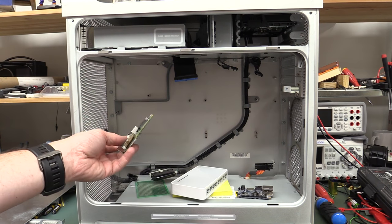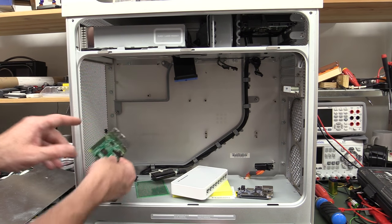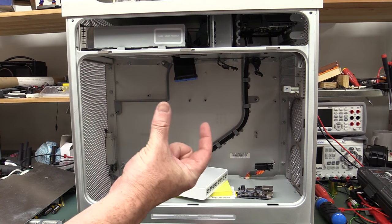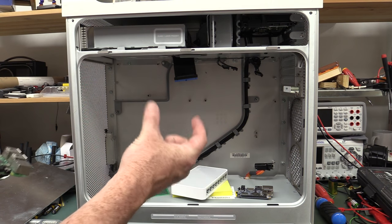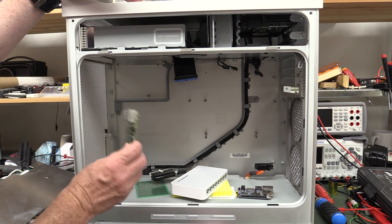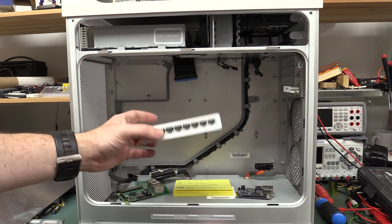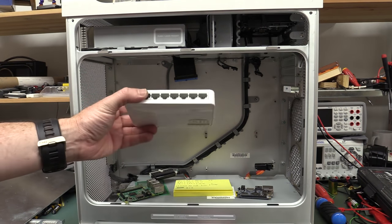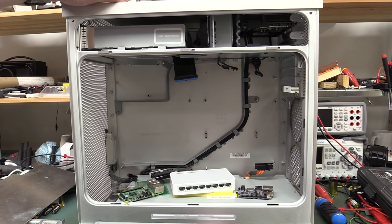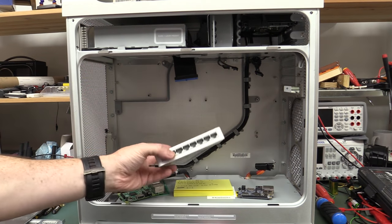But if you did it the other way, and you use the Ethernet and you actually had vertical RJ45s on your motherboard here coming out, and then little short cables, you can actually buy pre-made little couple-of-inch-long Ethernet cables. So you could use those, but then you've got to have the magnetics on there. You've got to design basically this switch onto your board, which is just a single chip solution. I tore this apart last time, but you can design that on there. But then the magnetics and everything else, is it worthwhile for a one-off project? You could almost say you're better off, if you had the room, actually buying these, stripping them down to board level, and then just sticking that board onto your motherboard.